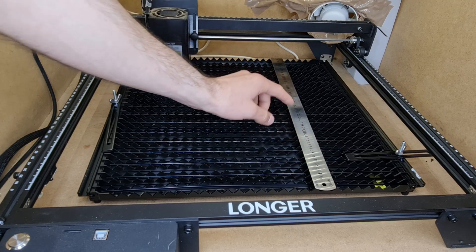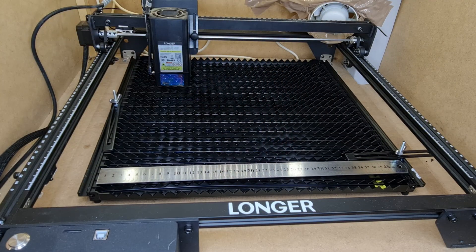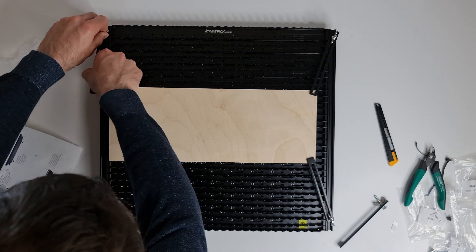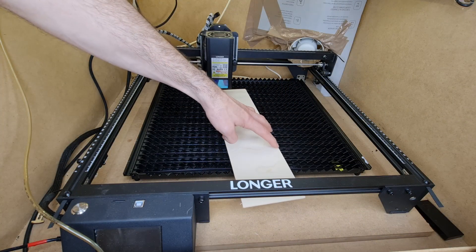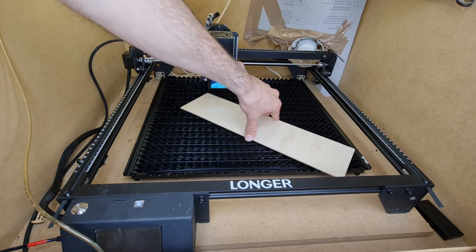The design is clever and elegant, although I do not think the black coating will last for a long time. The key features beside the bed itself are an effective area of 420 x 420 mm, which is larger than the 400 x 400 engraving area of a typical desktop laser engraver and does not have any crop due to the frame along the perimeter. Then there is a built-in clamping system. You have the possibility to extend the area by adding additional Maker F3 units. The flexible blades which alternate the rows can be removed so you can get an even cleaner job — however this is applicable only if you are cutting not too small details. The last feature is the flush design of the bed and its frame, which allows longer sheets to overhang the side without creating a height difference, allowing you to get a consistent cutting.